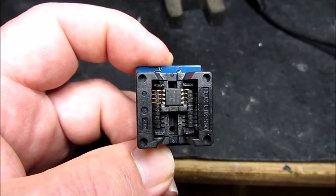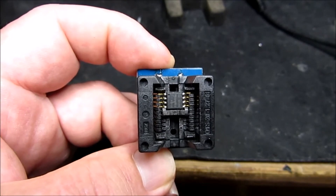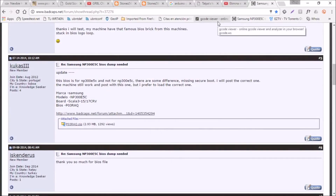Now we can see the chip mounted in the holder, ready to program. This is the page where I found the BIOS Samsung provider utility to update the BIOS, but it only works if you can actually boot into Windows — you can't get the binary files on their own. Kindly, these folks have uploaded the BIOS, and that's where I got it from. I'll put a link in the description to that.